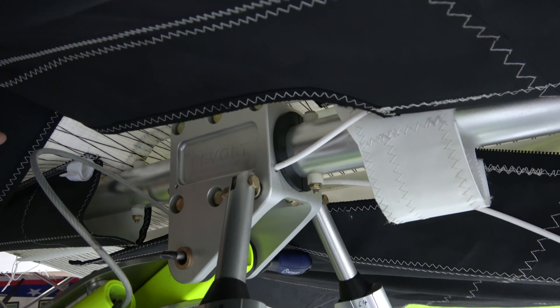I'm going to pull the wing down nice and slow. Coming out to the front of the wing, you can do a much better job of watching to make sure the wing tips don't hit anything. Once it's separated, we can move the carriage out of the way. At this point I can release the mast and release the brake. If you're going into a trailer you may need to keep the mast down — you can leave the ratchet rope on, or remove the mast lift assist and pad the top of the mast so it comes down to the top of the forks and tie it down that way.